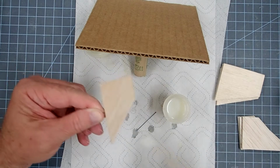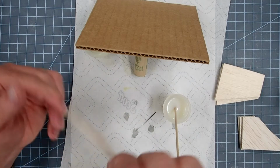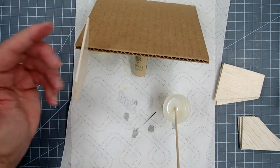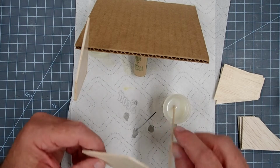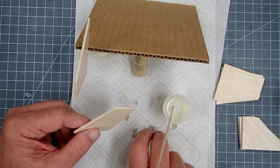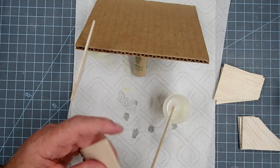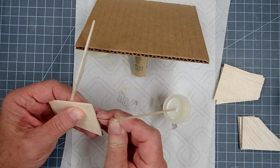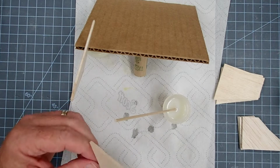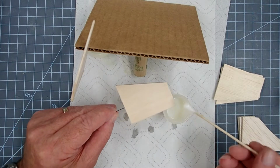And then after I've sanded this, I will put another coat on it, let it dry for 2 to 3 hours, and then sand that with 320 to 400 grit sandpaper. Now if you've got limited sandpaper supply, what I would recommend is get yourself some 220 grit or 320 grit, so that'll be your fine sandpaper, and also some 150 grit, which is a medium grit. If you just have those two, like a 150 and a 320, you can work around just about anything here.